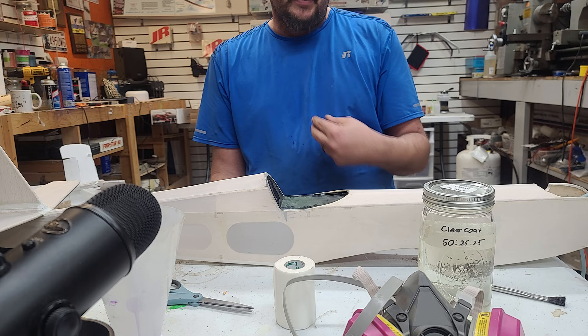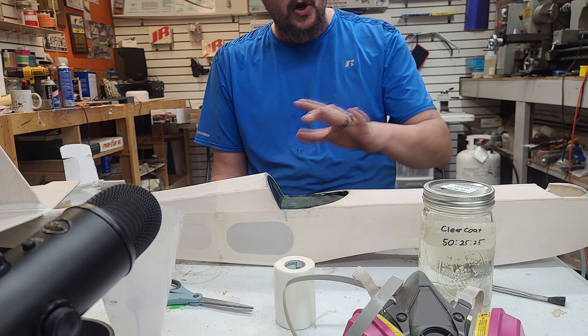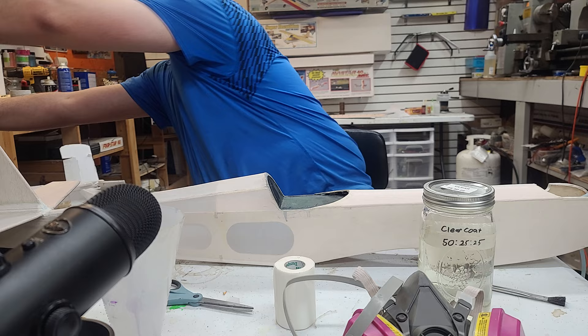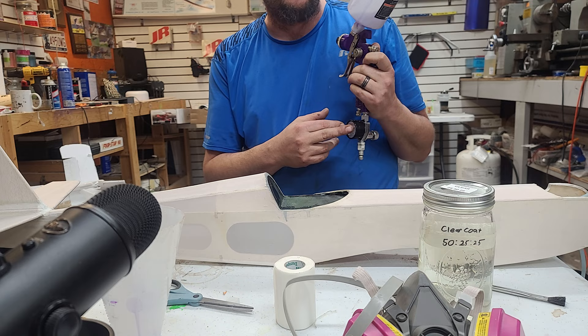The retarder is added to slow down the rate that it dries. At this point you can brush your clear coat on if you want, but not all your brush strokes come out doing that, so I opt to shoot it with a spray gun. I got one mounted here — it's a spray gun I got at Harbor Freight for $15. Make sure you buy your throttle valve — that's a regulator to add to it, it does not come with it. I think it was like eight or nine dollars.